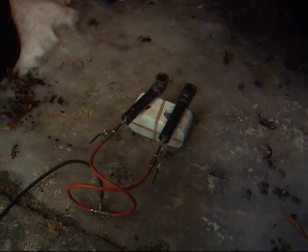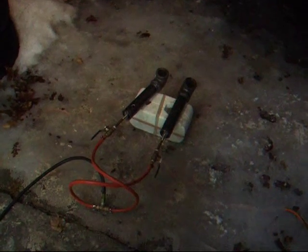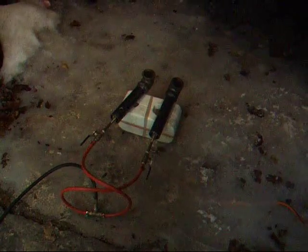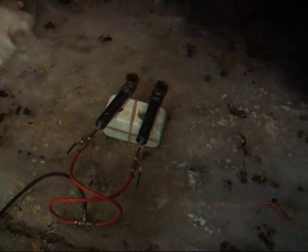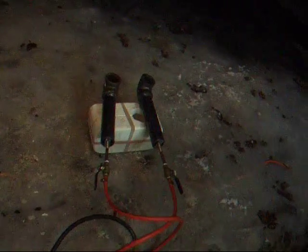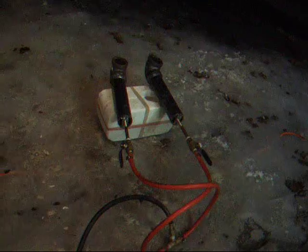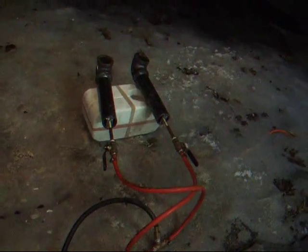Here's my test for the burners. I changed the orifice size to 1/16 of an inch. A number 50 drill bit was way too big and they were running really rich. Number 54 was too small — they were running a bit lean. So this is 1/16 of an inch and I hope this is good. Let's test these out — turning the gas on here, a little bit of gas going, and here we go.